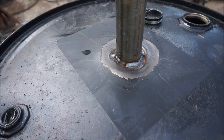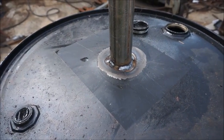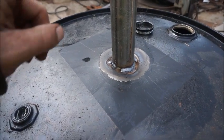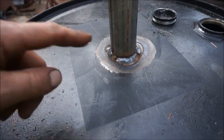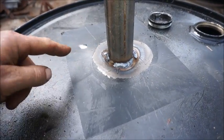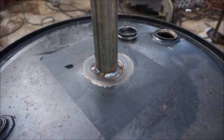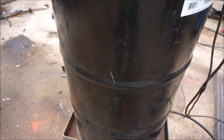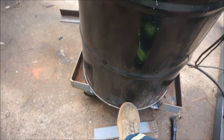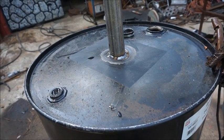This barrel's some thin stuff, but I've got the pipe welded in there — I'll need to be a little more careful. I like to weld hot. It's four inches down in. Now this is not galvanized — it's aluminized exhaust pipe. Now I'm going to cut this off, put the cap back on, and cut this barrel to the height we want. We'll cut it down here somewhere for the lid. And like I said, this is the bottom.